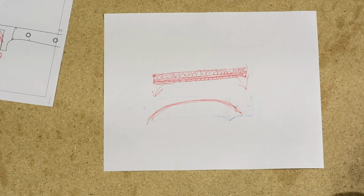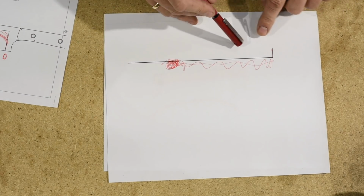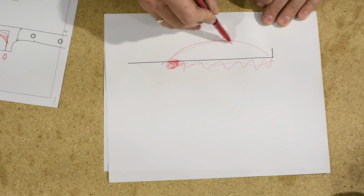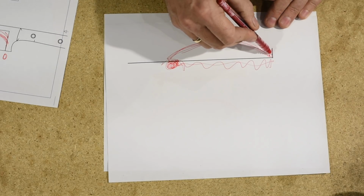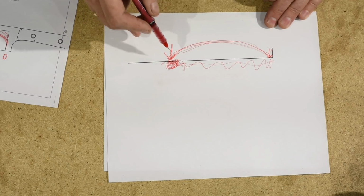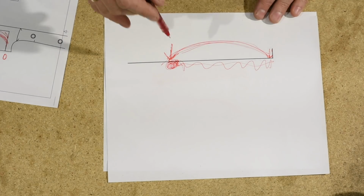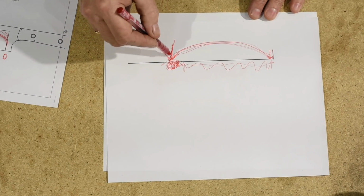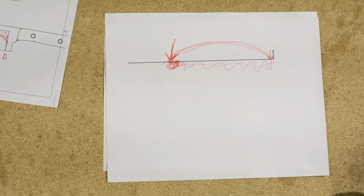The result of that is that once again, if this is your plunge line and your knife blade, the belt will start to do like this. And so once again, it'll apply a little extra pressure right here, but worst of all, it applies extra pressure here. So just another compounding effect to make time, geometry, physics. It doesn't happen with all belts, but with some belts it does, cloth back belts especially, and that little problem just compounds everything.